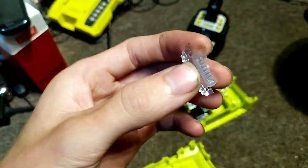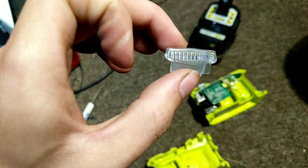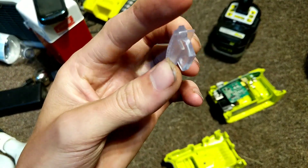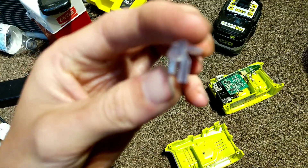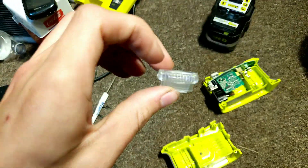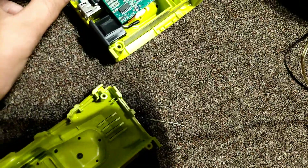Before I do that — an interesting little thing I just noticed with the lens they use for the light: they've got this light piping effect going on. The light comes out the front right there, but the way they have the back directed is to channel the light up this little channel. And they have a 45 degree angle in that channel to act as a mirror, reflecting the light from the LEDs which are facing directly down.